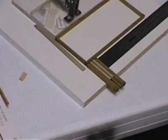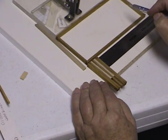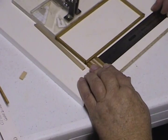Now, here I've got the other cross pieces. I've set them up, how many I'm going to use there, and I just lay them at the end of the wood and then calculate that along my ruler. Measure along on my ruler and see what the number is there, and divide it so that I can see just how wide apart to make these pieces when I put them into place.